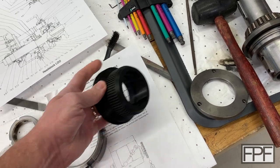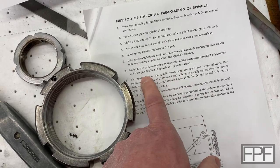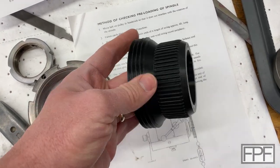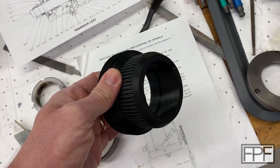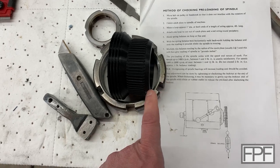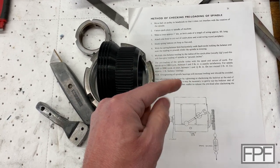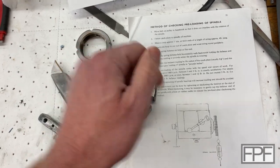Why two inches? Because the radius of two inches is one inch, and then our math to achieve the amount of pound-inches of force on the spindle is multiplying the value by one — so there's no conversion needed. I think we'll have the most accurate measurement at that diameter as well. I'm imagining basically the existing cap but with what would look like a spool for thread coming out, a way to attach the thread at some point, and probably a tapered or rounded edge so that if we get close to the edge we're not catching on a hard sharp edge as we're unwinding.